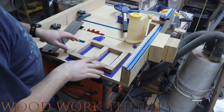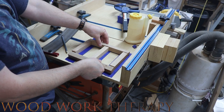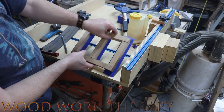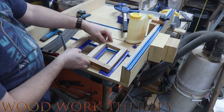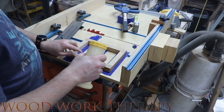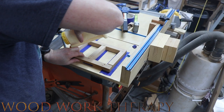Okay, so this is basically our configuration. It's very similar to the front, just measured out to work with my specific hinges. And I put tape back here, so you can hold it together while we're gluing, so that way we keep some accuracy. So just like before, we're gonna add dowels to this, so we'll of course do some precision doweling. Again, dowel jig, just gotta have it.